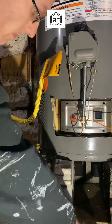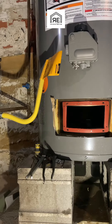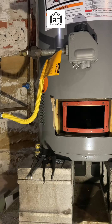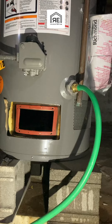Now you absolutely don't have to take this out, but if you don't take it out, just make sure you're not going to drip any water or anything down into any of the tubes. The best practice here is to get a half-inch piece of pipe and screw it in, so you can just unscrew the whole valve that way.